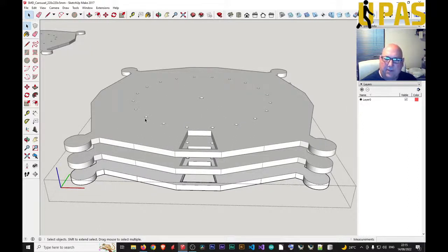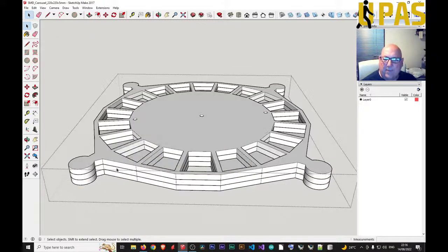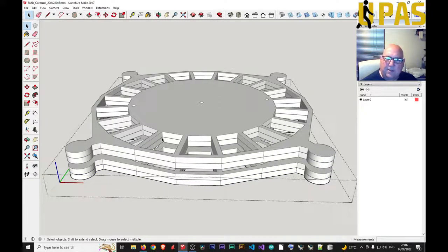It's got the 3mm holes in, no, 2.8mm plunged holes for the 4mm bearing to sit on. 4mm hole, and you've got the pockets that go all the way through. It's showing you these extra two because I made it as a component, so just showing where they are. Okay, so I'll come out of that. Now the second layer is this one here. It's exactly the same, but it's got cutouts all the way around, and it hasn't got the 2.8mm bearing recess. It's got instead a 4mm recess, and to tell the truth, I had to open it to 4.2 with a drill manually because the 4mm bearing wouldn't drop in and out of it. So this needs to be changed to 4.2. That's 4mm. These two are 4.2.